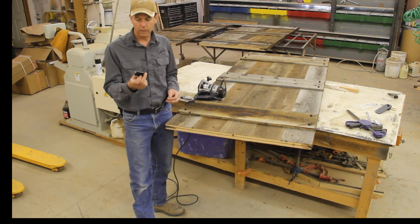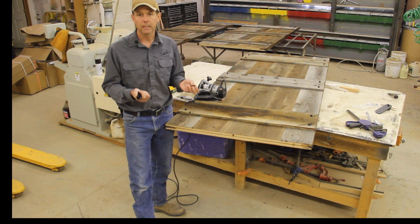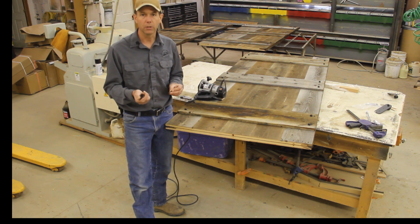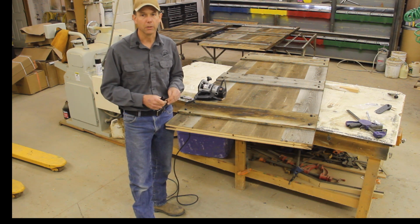Now, one thing with installing the floor guide to the floor is since we send wood screws with it, it's typically easiest to put it into a wood floor. If you have a concrete floor or a tile floor, you may need to substitute some masonry anchors in order to install your floor guide, or epoxy or glue it down in some fashion or another.